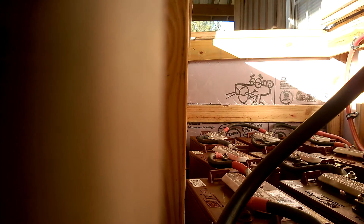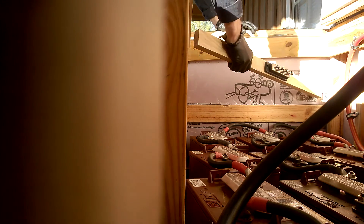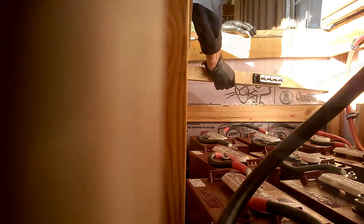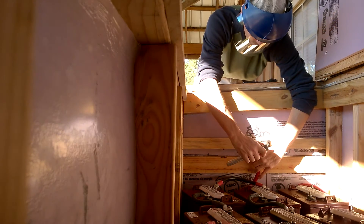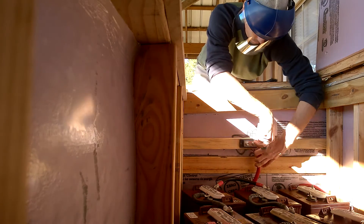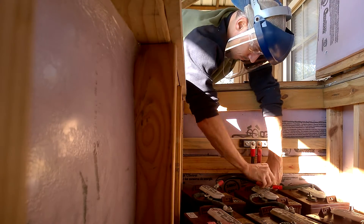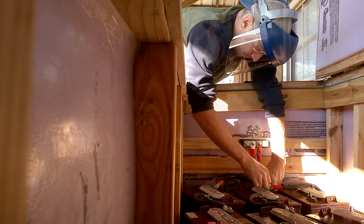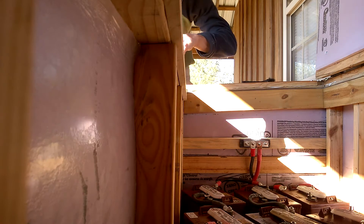We're going to move these batteries into their own battery box. I'm going to have a little 1000 to 1500 watt pure sine wave inverter for a separate small system, in case I don't want to have all my eggs in one basket living off-grid. These batteries still have some life in them — just with our needs in the summertime, especially to get a deeper cycle battery setup here.